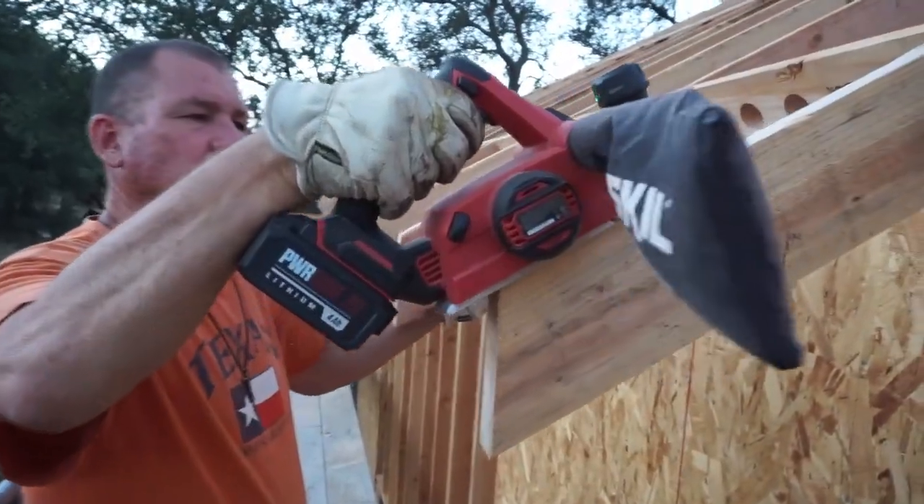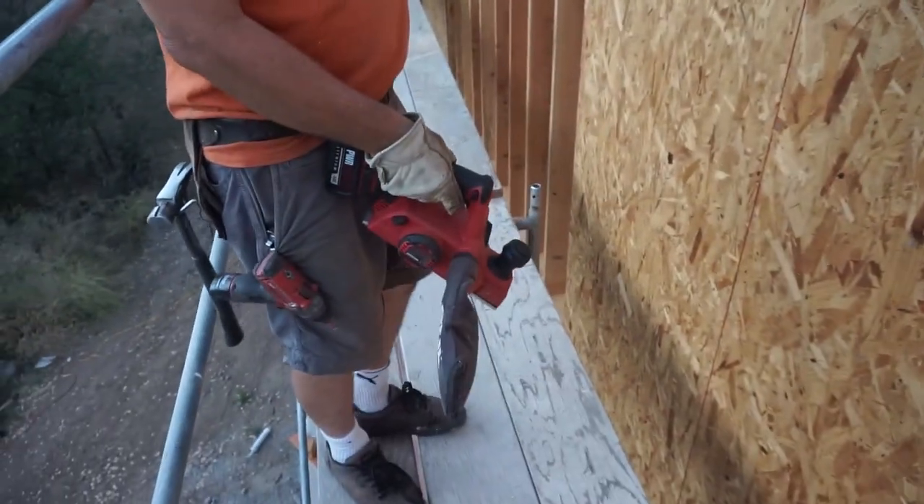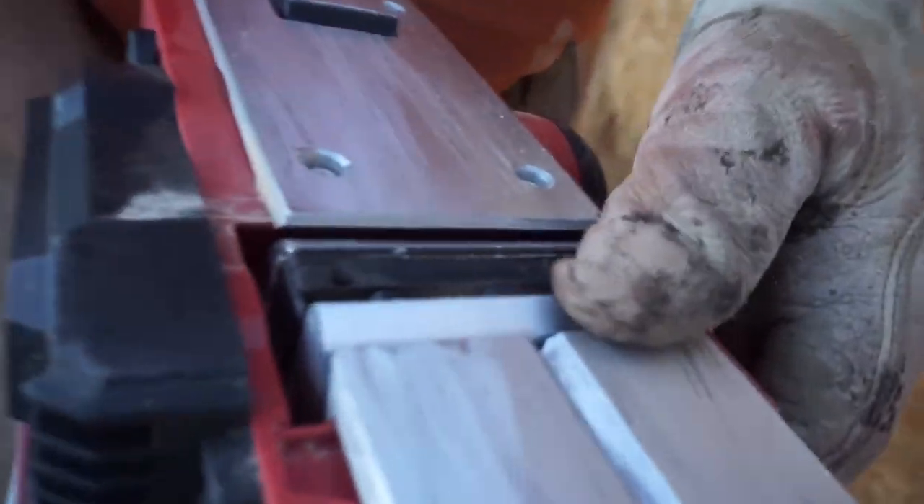With those values in mind, we're going to take a planer and plane the top of those boards, trying to keep everything as parallel as we can with each other, to get the top of those corners perfectly flat all the way down. This cordless planer is sick — it's got a bag to catch the sawdust. Don't put your finger in there.